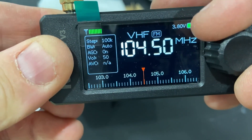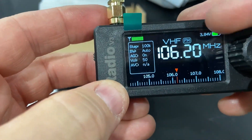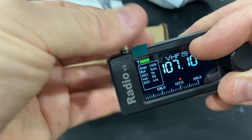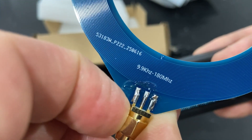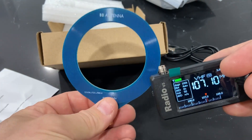Still crappy reception — I'm really not getting anything. Okay, I got something there. It sounds like something. Obviously it'll sound better through the headphones, but I didn't get this thing to listen through the speaker. Let's disconnect the antenna — yeah, nothing. Little wire loop — it works. Not for shortwave though. What does it say? 9.9 kHz to 180 MHz. So that's good for FM, but maybe some shortwave that's higher up. A lot of the ham stuff is around 3,900 kHz and 7,100 kHz, so this is not going to work too well with that anyway. But that's a BB antenna.